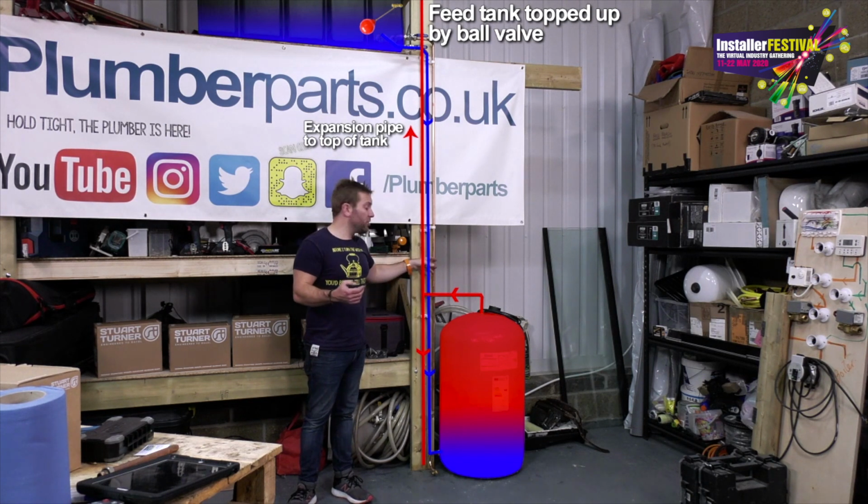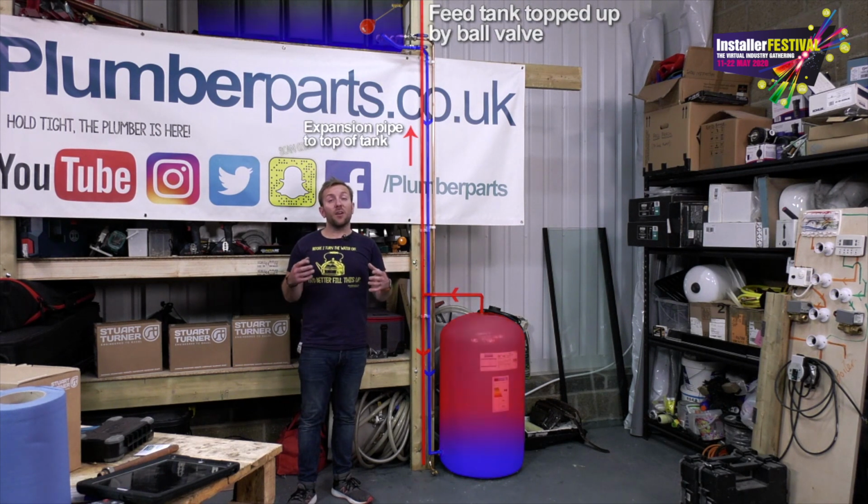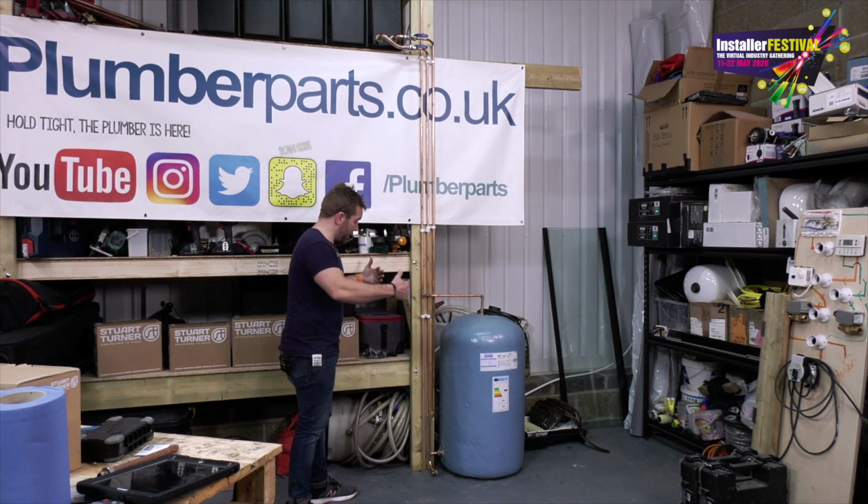Remember what I said, I can't stress this enough. You usually wouldn't do this in 15 mil. All this would be done in 22 mil, and only the last little bit going to the shower feeds would be in 15. What I'm going to do now is build our little bit of wall out.